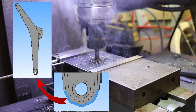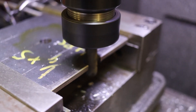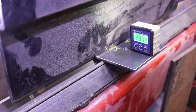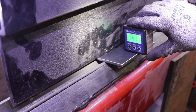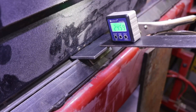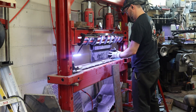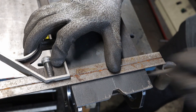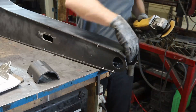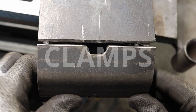Here I'm making the bottom skin for the boom. I almost reached the smallest bend-to-edge distance I can do on my press — so much that the protractor won't fit on the part anymore. I made the underskin longer in case I got the bend locations wrong, and to make it fit I just needed to cut the extra material. And now it's too short. Well done, Vinnie. But it can be fixed with a bunch of welding passes.